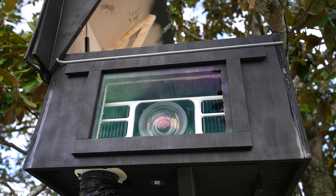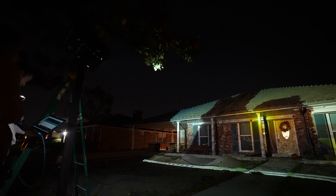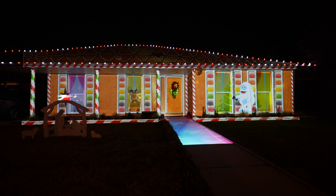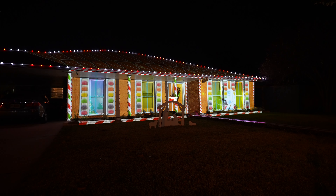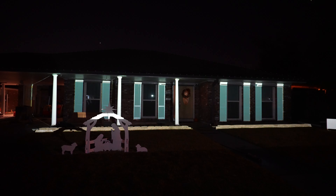The projector is where it all starts. Most people need a short throw projector because if you think about a non-short-throw projector with a 1:1 ratio and your house is 60 feet wide, you'd have to be 60 feet back to project onto it. That's why we go with short throw projectors — a projector can be 20–30 feet away and get a wide spread to cover your entire house. If your house is light colored you're probably good to go with standard projectors that are three to four thousand lumens and it'll look great.